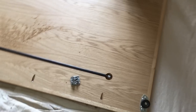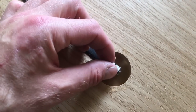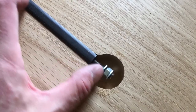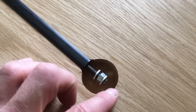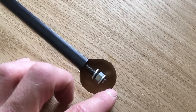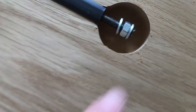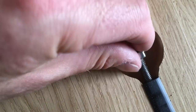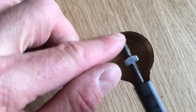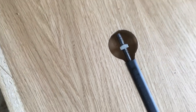Now that we've established the direction of nut movement — shortening the bar, putting it under tension, pulling the door in — I'm making the gap bigger so the bar has further to move. It did work very well: we've done that on both doors and got a nice even gap. I felt it was starting to dig into the MDF, so I positioned the fitting nearer the end. The bar will end up nearer the top, but that's fine because that's not a direction of adjustment we'll need.